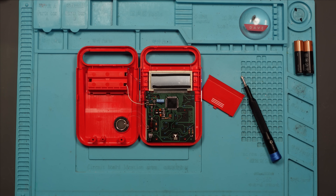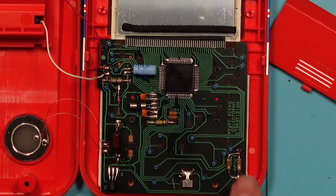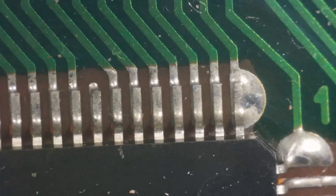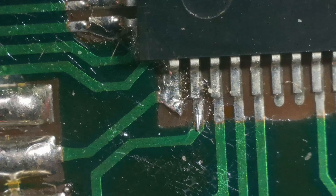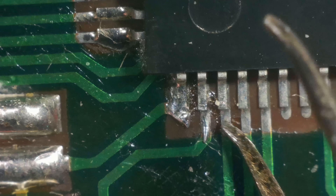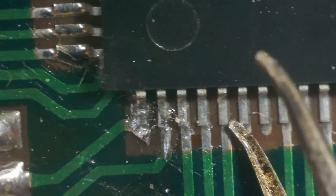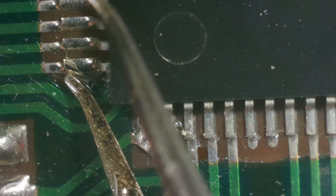I don't think I'm going to be able to fix it. Maybe it is the crystal, but the fact that the time worked, I don't know. And I also don't know how to test crystals. As I suspected, there's no corrosion. Let's have a look at it under the microscope — I can't see anything with the naked eye. Actually, close up it doesn't look as good. That's a bit of a mess. The solder test would suggest that these are okay — I will go around and check them all, but I'm not sure it's that.